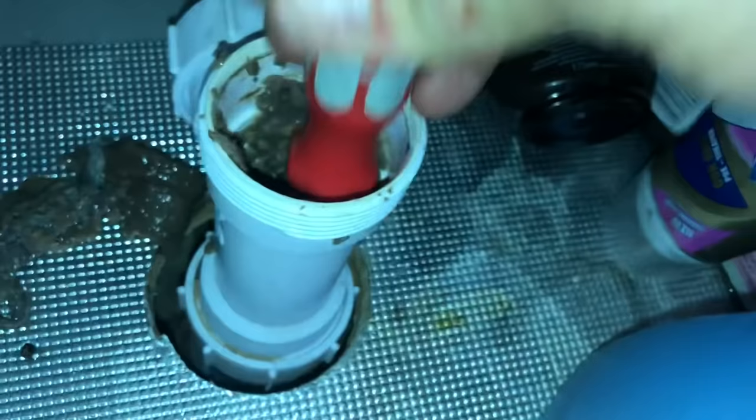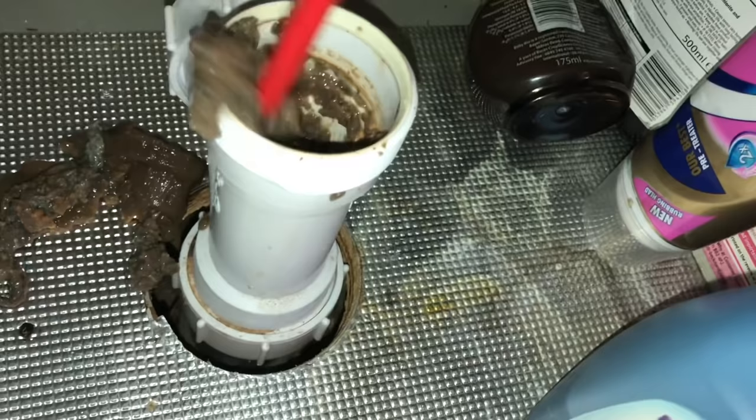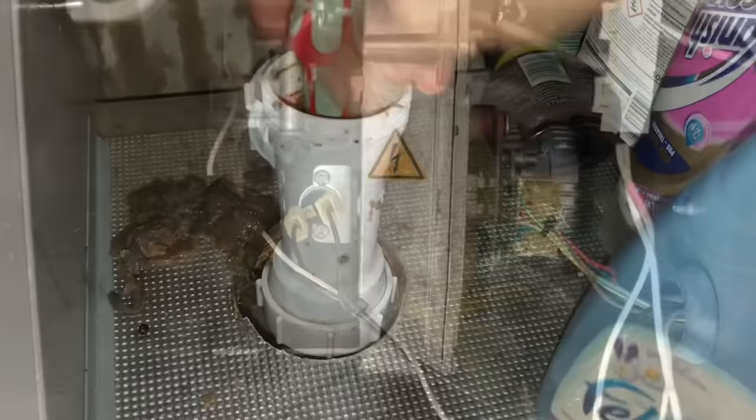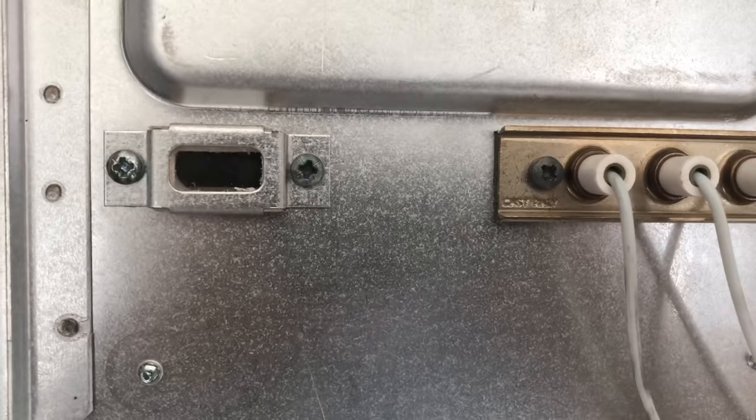Basically cleaning this out and releasing all that backed-up condense water will empty the condense trap in the boiler. On this model, once it's empty, you normally have to wait for it to dry out, but I'm just showing you — I've plugged it back in, drained the water out, we know it's clear, and the boiler is going to light and stay lit.